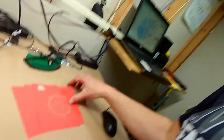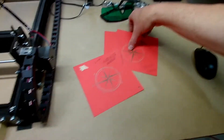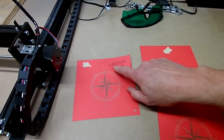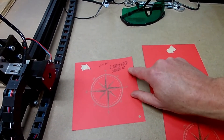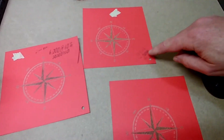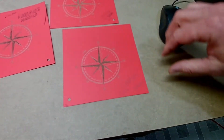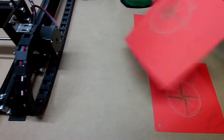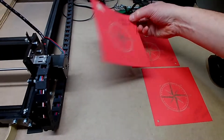I'm at a loss — I don't know what more to try here. Here's some sample cuts. There's some paper that I had available, trying a variety of cutting speeds. We tried 6,000 millimeters per minute at 60 percent power — this one actually burned fairly well, they're straight. I did some slower burns: this is 500 at 10 percent. Different resolutions between them, and again they seem to burn straight. It's almost as if the fast burns work just fine without a problem, but the slower burns — that's where I started running into some of the issues.